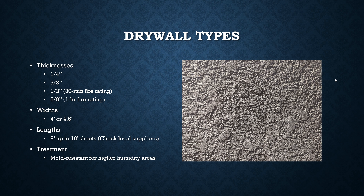There are several types of drywall to know. Regular drywall goes on standard walls and comes in multiple sizes. Lightweight sheetrock is made through a slightly different process and is lighter. Fire-rated sheetrock is usually labeled Type X, typically five-eighths inch thick. Mold-resistant sheetrock goes in high-humidity areas like kitchens or bathrooms — those panels resist mold growth better and are usually green or purple in color.